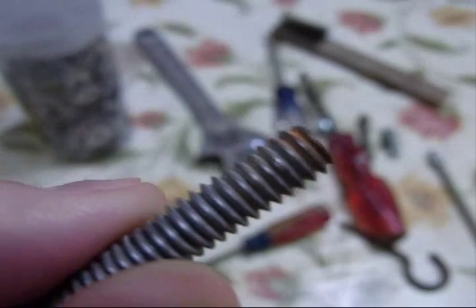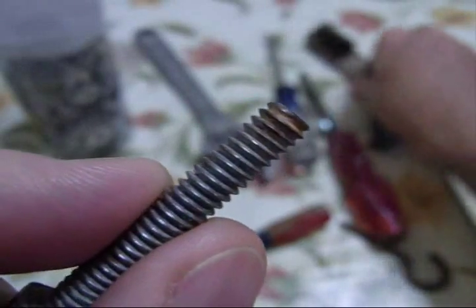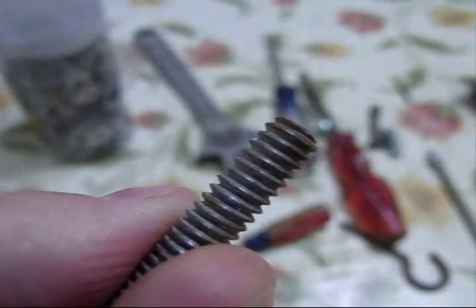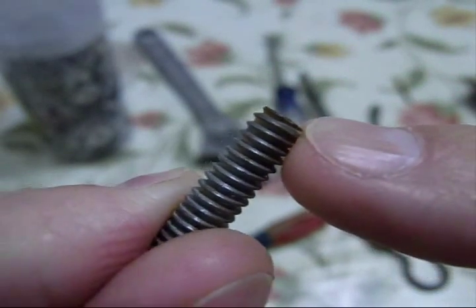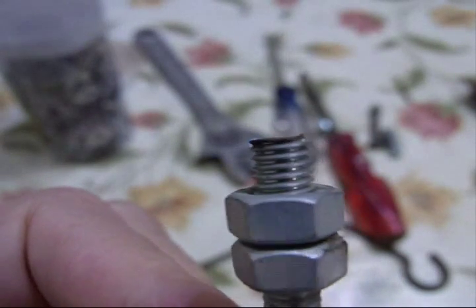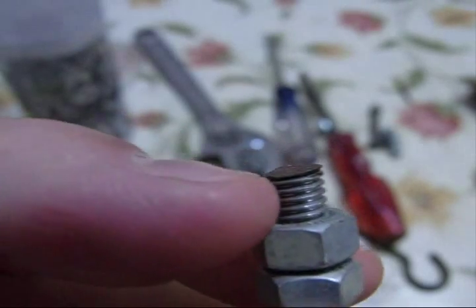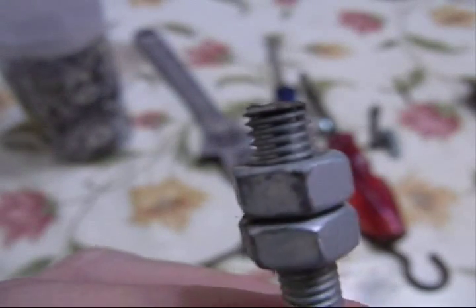The first step is to give the bolt a quick check and clean it if you need to. You can see this one is kind of messed up here — just get a brush and make sure you get a nice clean thread. Also check the end of the screw to make sure it's not messed up. I've got one here that is — you can see the end of the screw is not nice at all. It's been cut, it's a mess. They get nicked and dented and the bolt won't go on there nicely. First step: check and clean as needed.